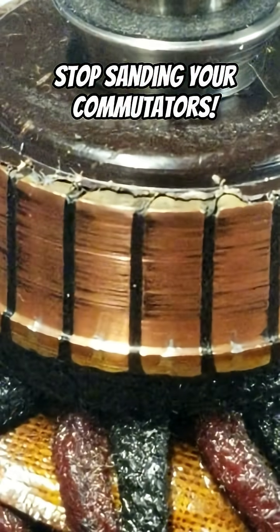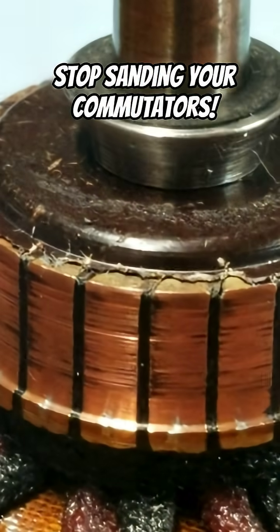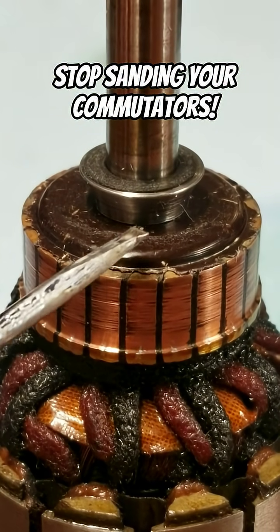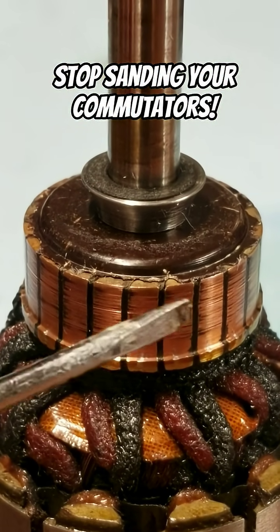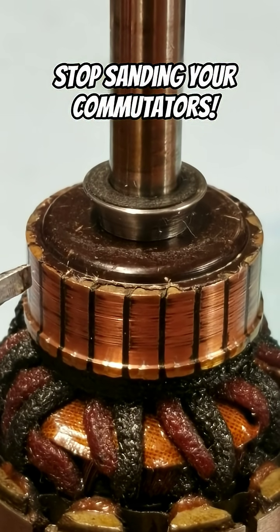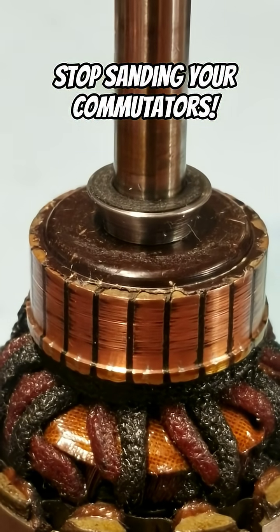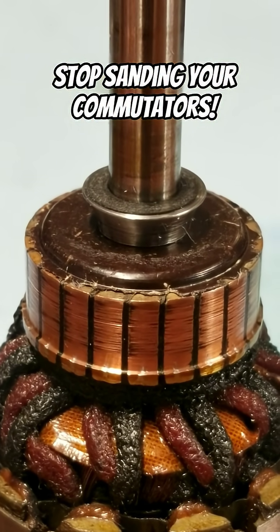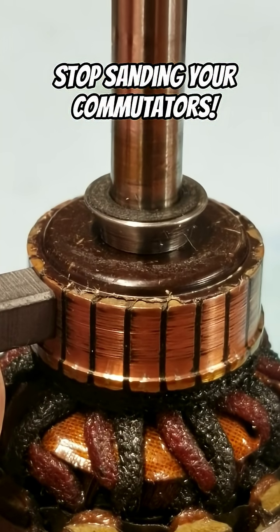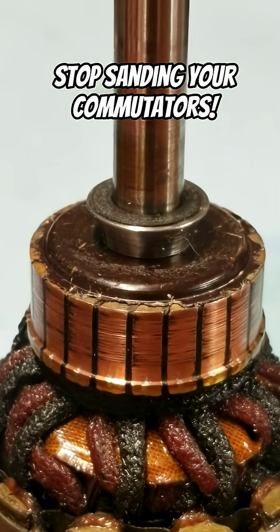I think that is the way this was manufactured. What I'm guessing they did was after they poured the bakelite and it molded itself, they probably had to machine it away to create this perfect cylinder shape. And the sandpaper that people have been using is changing that geometry, which means you're getting less electrical contact with the commutator.